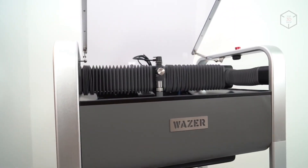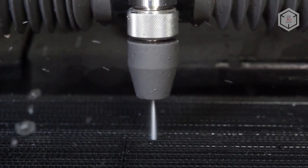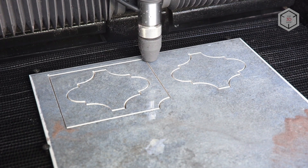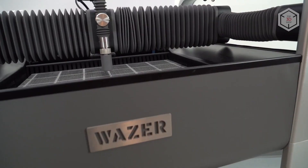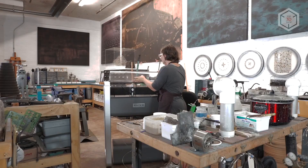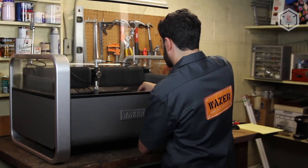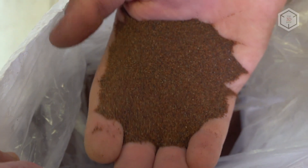Any complex equipment requires a serious approach. Let's start with safety. The working space of the machine is closed with a plastic cover, and the lid has shut-off protection — the machine turns off when the lid is opened. There's also a safety feature preventing fingers from reaching between the cutting head and the material. The main Wazer cutting module has dimensions of 856 by 648 millimeters, with a height of just over half a meter for the desktop version and over 1.2 meters for the stand-up version. The provided pump measures 533 by 355 by 280 millimeters. The main module and pump weigh 50 kg and 42 kg respectively.